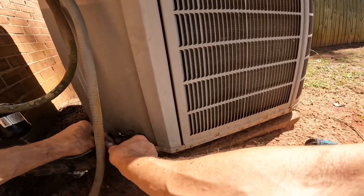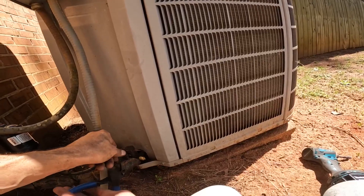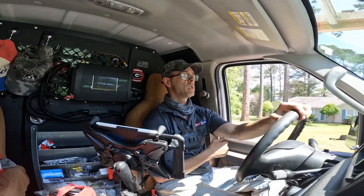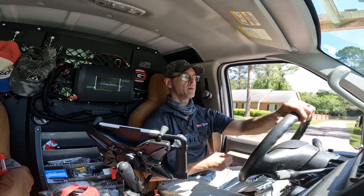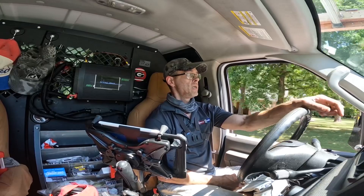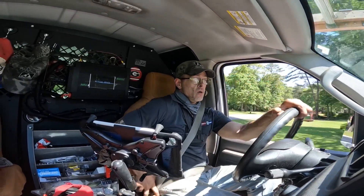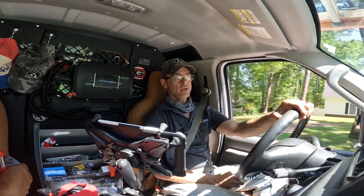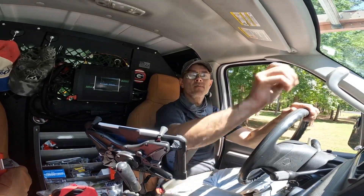And as you might imagine, that is going to be a nice little paycheck. Alright, I let that thing run as long as I could and I had slightly overcharged it, so I had to recover some. Thankfully my recovery drum just had a tiny bit in it. But that system is good to go. I just didn't wait long enough for the pressures to settle out and I was having trouble running it. I had to reprogram the thermostat so I could run it to a lower temperature. But we got it done - that is a good little job. I hope you enjoyed the video. Thanks for watching, I will catch you on the next one. Bye.